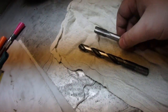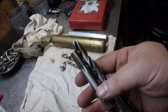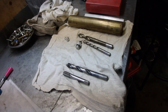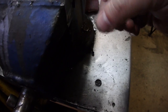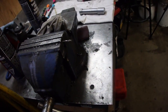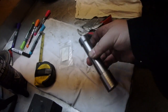This is where it gets interesting — I need a 33/64 drill bit but the closest thing I've got is a half inch, which is just one size smaller. I might have to get the boring bar out and punch a hole through. I think we got her — actually it's coming. I put the drill bit in farther than I should have and there was nowhere for the chips to go, so it bound up inside. My own stupid fault — I was worried I was gonna break it off and ruin my piece.